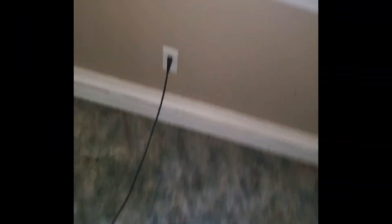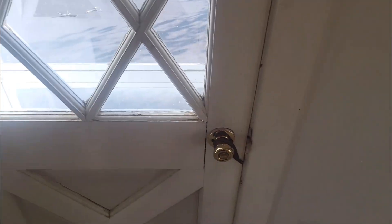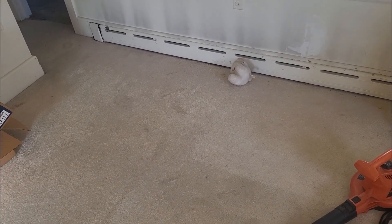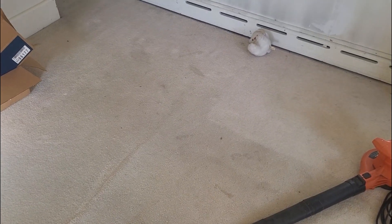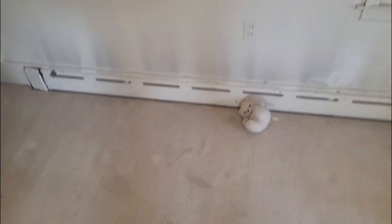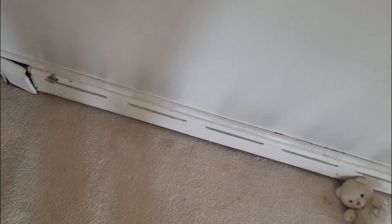Let me check the other ones. This other door was interesting — I thought it was a patio exit, but it's a one-way ticket to the roof. On the other side of the third floor, all these are hot. So if I know I have enough boiler pressure and half the radiators are hot while the other half I'm getting water out of, I may have air and may need to bleed at the drain valve on the boiler. But first I need to identify which zone is which — it's numbered, not labeled by room.